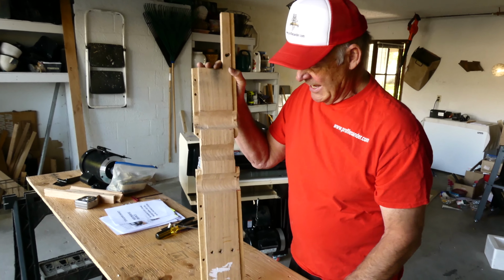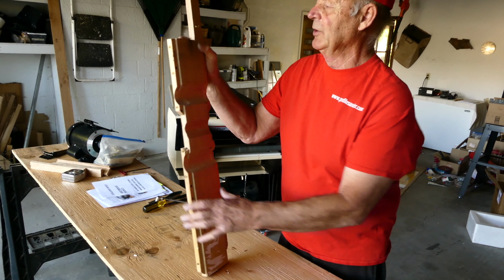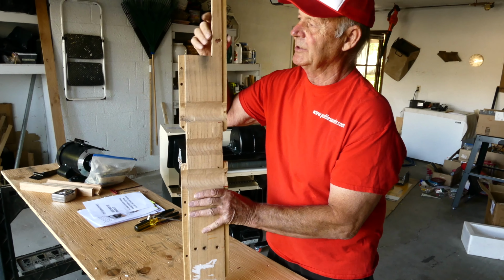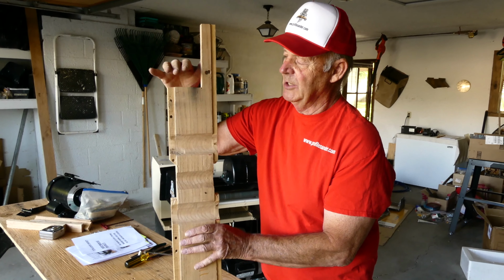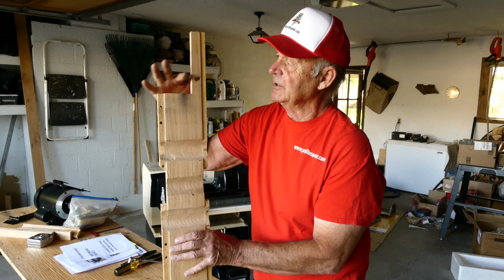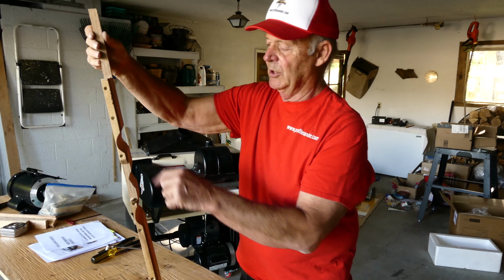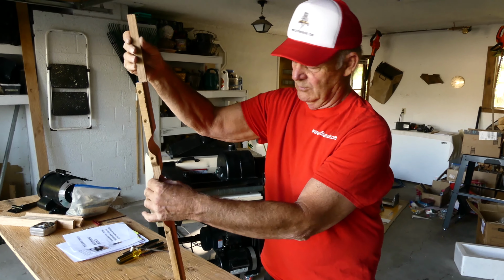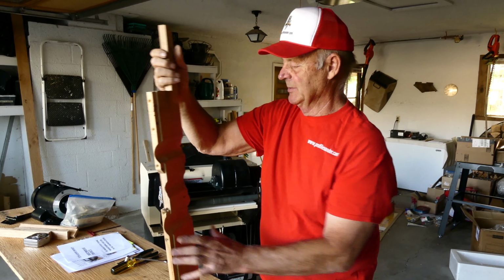This is a guide that I made up, and it works really well. You can see that it's cut out here so you can bolt it down, so the width of your trim with a 6-inch sanding head, you're not going to be eating up your brushes by hitting your guide. So this is for the guide itself. And you can see it's just like the rest of your guides that you either made or have come with the machine, that they're dished out here. So your feed roller pulleys, your drive on your molder head will have room to make the adjustments.